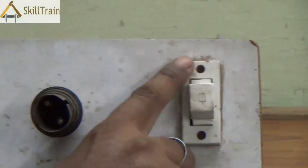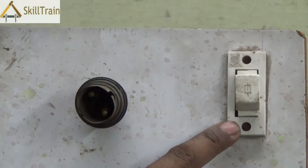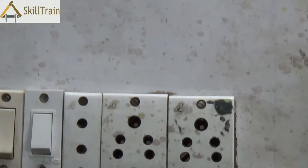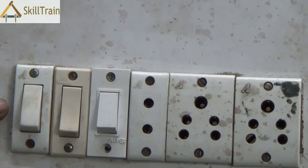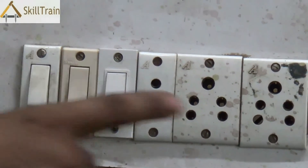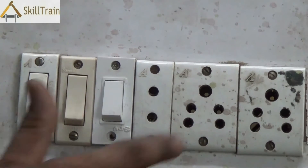All of these boards can be fitted with a fuse to ensure that if there is any overload the fuse gets disconnected. The fuse is always on a series connection. The switches are also placed on a series connection and, as mentioned in our earlier video, they are normally placed on the phase line so that they disconnect the phase.